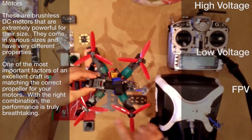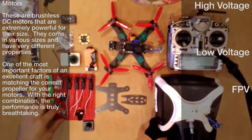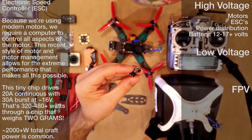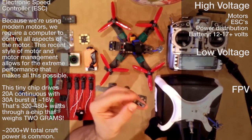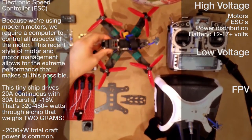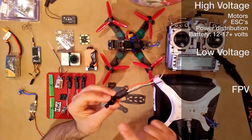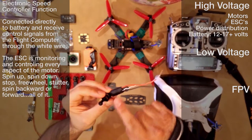You can see that there are 4 motors, and each motor has one of these — these are called ESCs, electronic speed controllers. This is what they actually look like without all that tape. This is called the Little Bee ESC. This one will dish out about 20 amps at 16 volts, with a 30 amp burst. It has a computer processor chip and it's controlling the RPM of the motors. Here's an example — this is one of the motors of the smaller craft I'm going to be building, with the ESC attached. Each ESC is attached to the motors and also has a ground and a positive line coming off them for the main power.